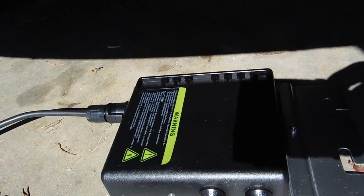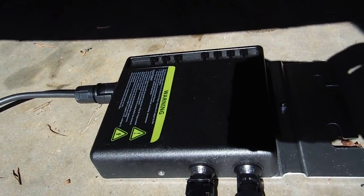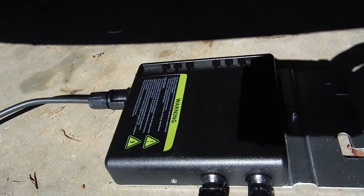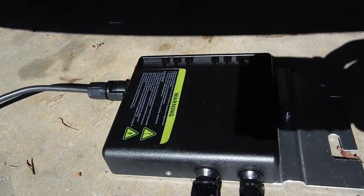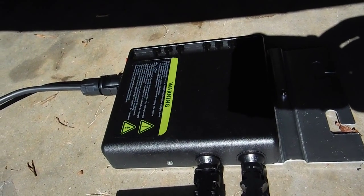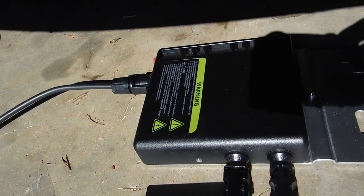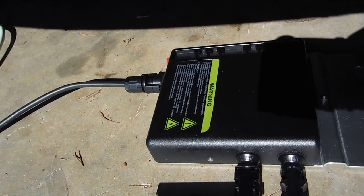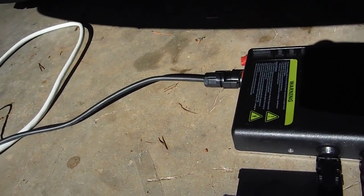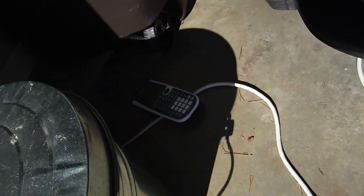It feeds into this WV-230 microinverter, 120 volt AC, that I picked up off of eBay also from industry-dancer (that's with a hyphen, industry-hyphen-dancer). That's 120 volt output. The nighttime usage I've measured is under a watt — I don't remember the exact number, I've got better equipment in my basement to check this with, so I'll retest that and post a follow-up. This just feeds basically right back into the wall.